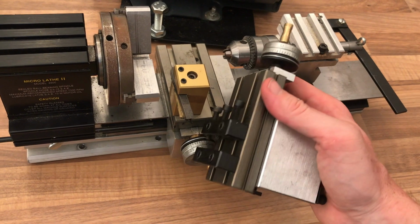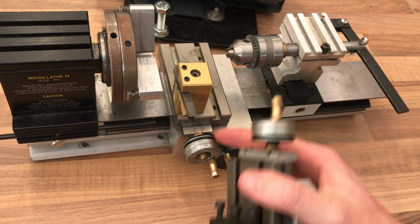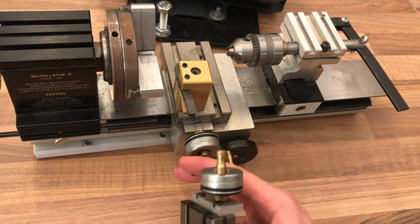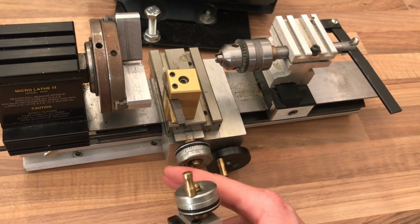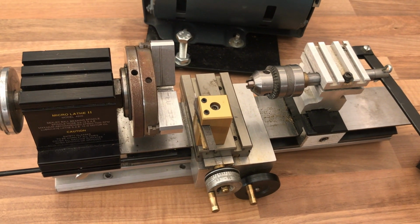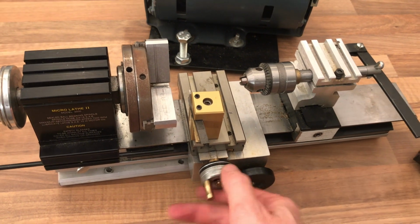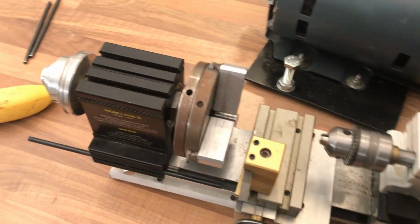If I ever do a little bit of experimental milling, then I'll just deal with the backlash at the time. But if I'm doing a CNC conversion, then that's a bit of a bummer, because I believe Mach 3 has some kind of backlash compensation, but there's nothing like sorting it mechanically. So some interesting stuff there. There's a few other bits.